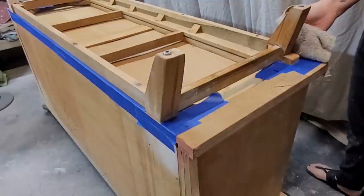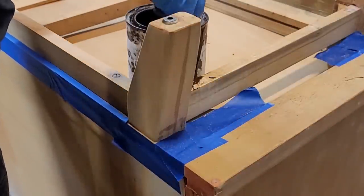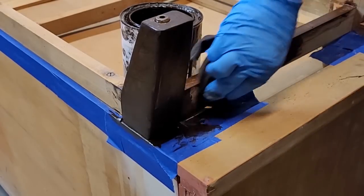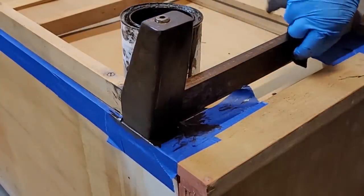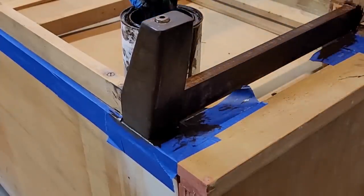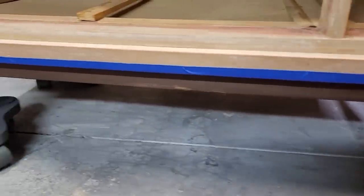The journey to figure out what this piece is going to look like begins. After all that sanding, I grab a damp cloth to wipe off the base and tape it off because I'm going to stain it. This is Dark Walnut by Varathane — a color I use often on my channel. I apply this stain and I'm kind of not liking it on the base, but I keep going and apply it to the wooden handles as well. I decide that this dark stain isn't really doing this piece justice, so I get my sander back out after the stain dried, sand it back off, and decide to go a different route.